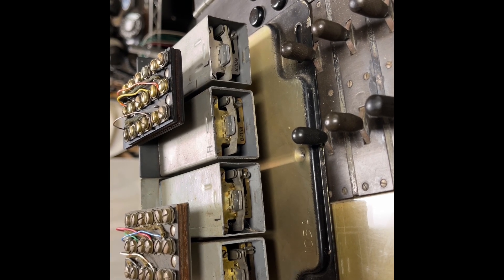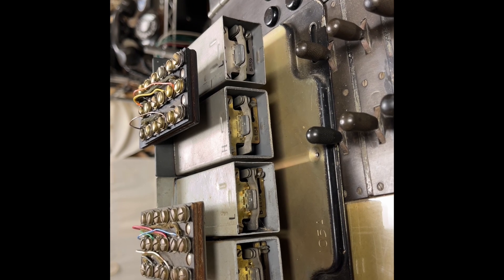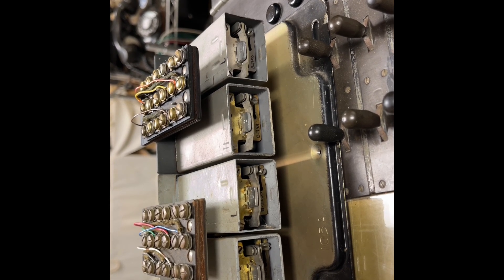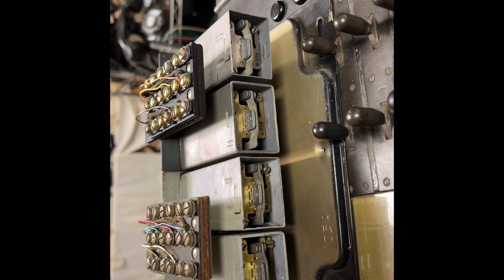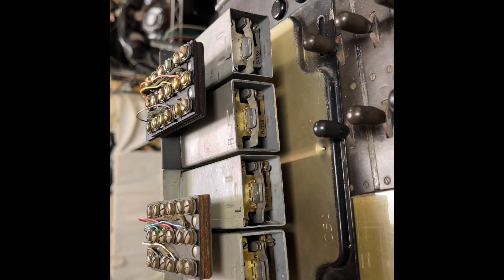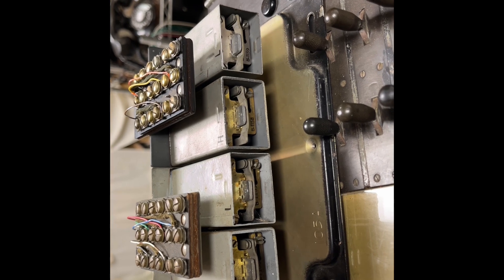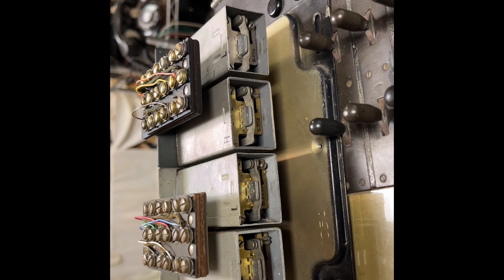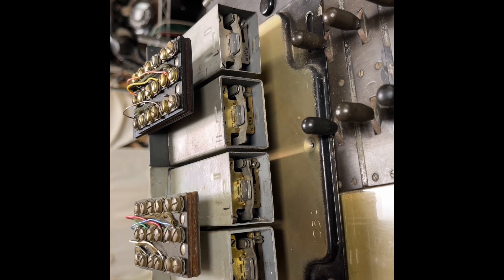The relays only operate from the phone line in series. They're very low-winding relays, so there's no external 24-volt power to this unit. I have basically four wires between the phone and each of these 1A KTUs. As I stated earlier, this is a very primitive system — a super ridiculously off-the-charts low-budget key system. But it did the job. This particular telephone company in charge of this phone and the switchboard is a really cheap operation and does not want to pay a monthly fee for the hold feature or the additional lines.